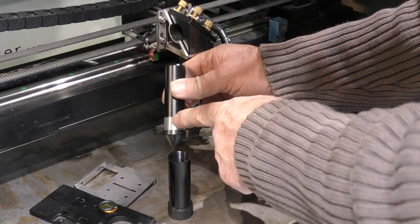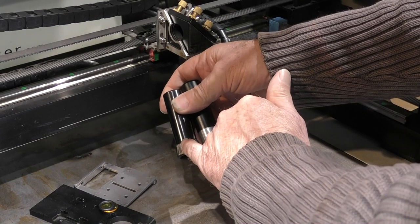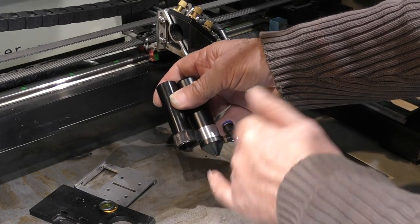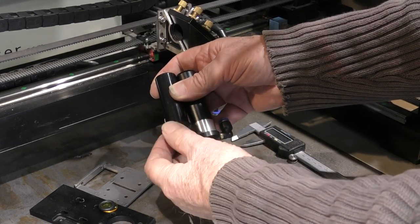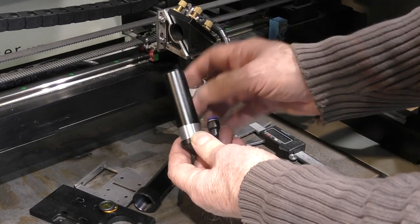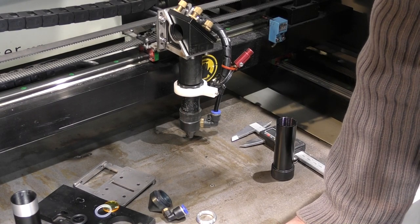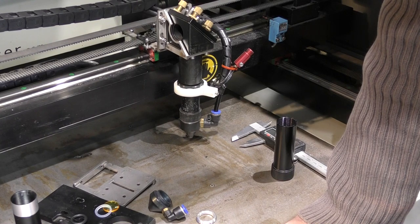Yeah, no, they haven't put a silver stripe around it. What they've done, they've actually taken away the knurling and the extra diameter at the bottom here. There is no logical reason why this has got a knurled bush around here, because the lens tube works perfectly well if it's a plain diameter. It takes nothing away from the lens tube, and it actually makes it more flexible in some way.